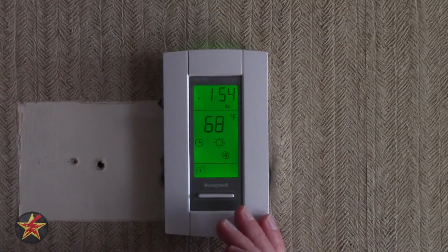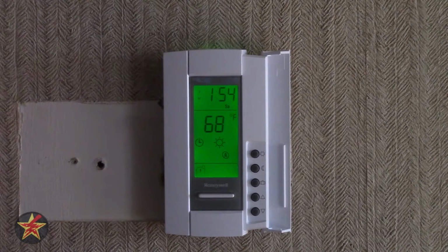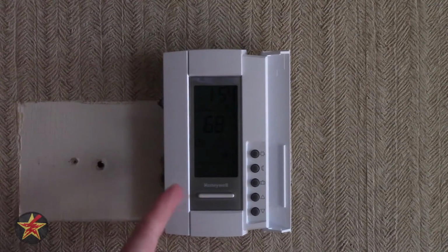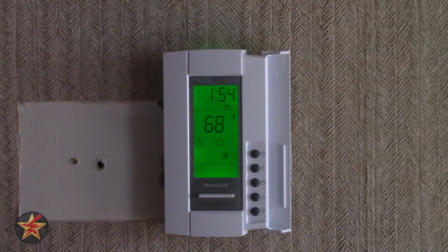and then you have to wait for it to get to temperature. Now, one of the benefits to this particular thermostat over some of the other ones I had looked at was it has, I want to say, variable heating stage, because it's not. It's a one-stage heating unit. It's either on or off. But depending on the temperature, it determines how much power it needs to send to your electrical baseboard unit.